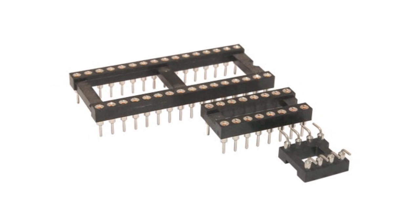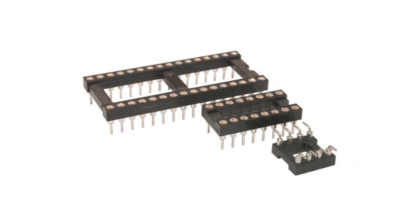The samples of such panels vary in docking height, which is the height of the contact block. There are single-row and two-row DIP panels that have a different number of contact pins as well as different docking widths of the contact rows. The Collet panel's special characteristic is that, unlike regular DIP panels, they have a tighter connection with the chip outlets.